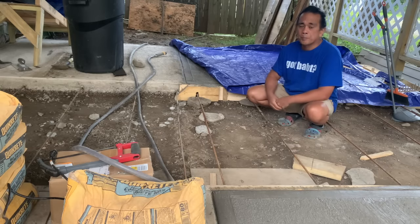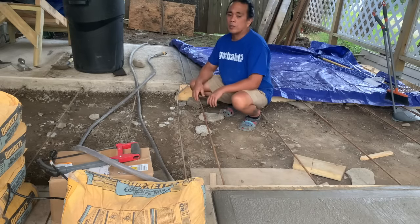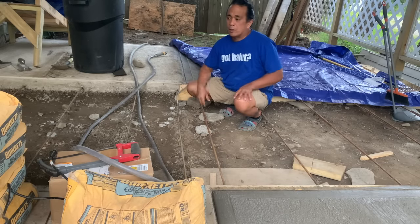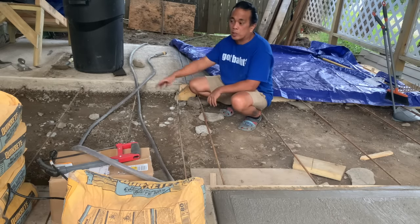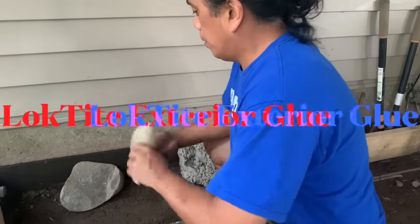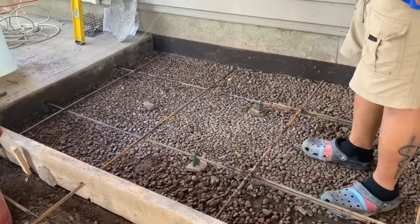I'm going to offset the next slab a little bit rather than just following this line across — I'll set it right in the middle. It's still going to be six-by-seven, but the end pieces will be a lot shorter, so I'm essentially cutting that in half. I'm measuring the expansion joint for the next half slab and using rocks to keep it up toward the house. Here I am removing a small part of the form, then tying the rebar at every intersection, and watering the concrete slab as well as the gravel so it doesn't absorb water from the mix.